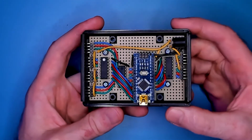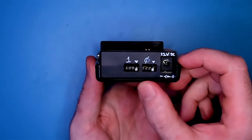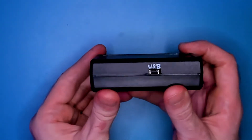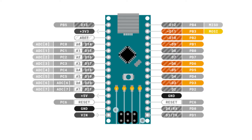And here's what it looks like fully assembled, with the 12-volt power jack and the first two LED headers on this end, the other four LED headers on the other end, and the USB mini jack on the side. To make the most of the LEDs though, I don't just want to turn them on and off — I want to be able to dim them so I can control the brightness and create a wider range of colors. Arduino's analogWrite function normally would be perfect for this, but only six specific pins are compatible with it, far short of the 18 pins that I want to use.